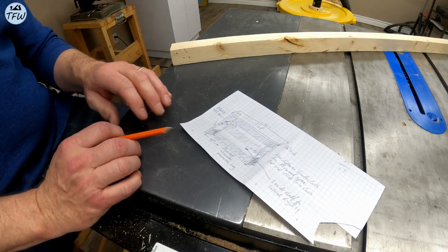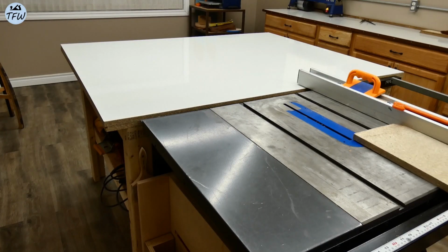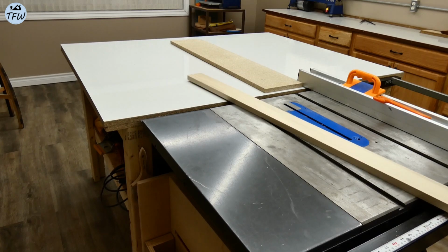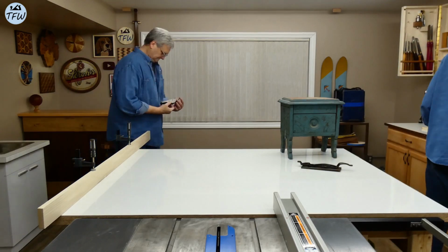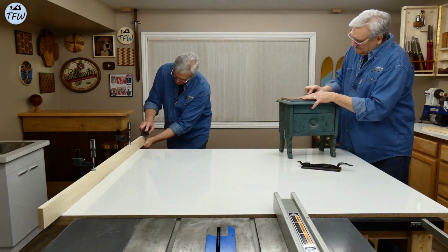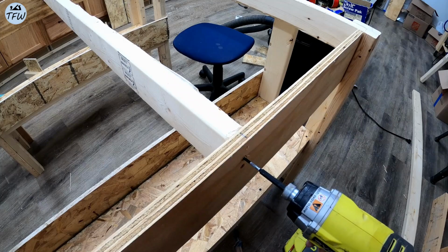I finally have my large center work table. It sits at the perfect level next to the table saw, allowing for cut stock to glide off the saw and be supported as it feeds. The same Formica surface is slick enough to allow for easy movement of the lumber, and when everything is cut, I've got about 20 square feet of surface to fabricate and assemble my projects. The bench construction is pretty basic with 2x4 legs, OSB shelves, and a double thick layer of particle board on the tabletop for extra stability.